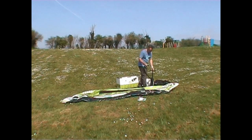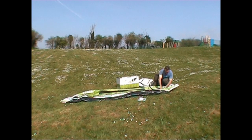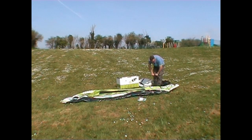I've also bought myself a 45-pound thrust outboard with a leisure battery and a little side-rigging kit for mounting the outboard on the back. Now that, with a leisure battery, with my kit and with two daughters on board, are still safely within the maximum capacity of 250 kilograms. So as far as weight is concerned, this can handle everything I throw at it. I've had the outboard on yesterday whilst it was perched on top of my trailer, and I'll extend my power cable from the outboard to the battery so I can put the battery up front to offset the weight at the back.